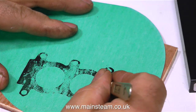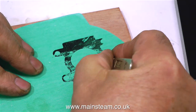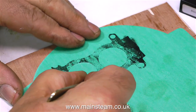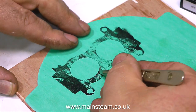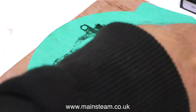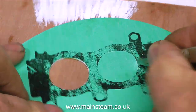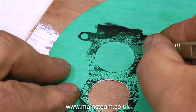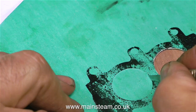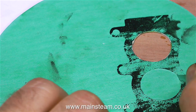It's good enough. I'm using a scalpel — if you use one of these, be really careful because it's extremely sharp. A health and safety warning: these scalpels are designed for cutting through tissue — skin, veins, arteries, removing organs from bodies and things like that — not gasket material. If you put too much pressure on, the blade will fracture and it flies across the workshop. And if it was to hit you in the eye, you'd know about it. So whenever you're using a tool like this, always wear some kind of eye protection.